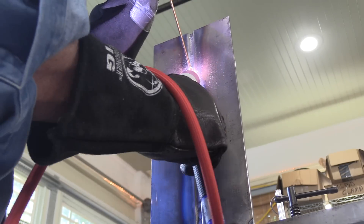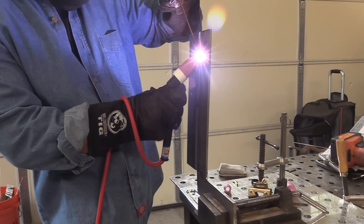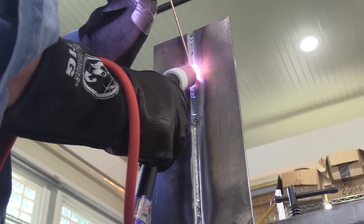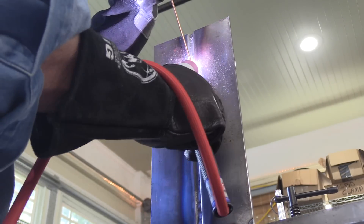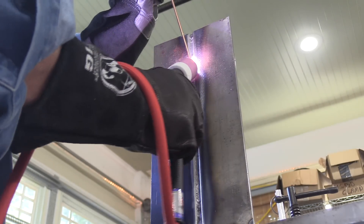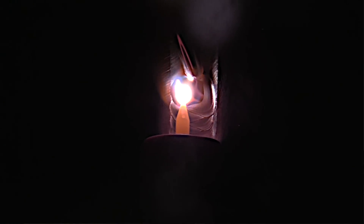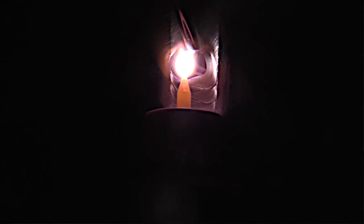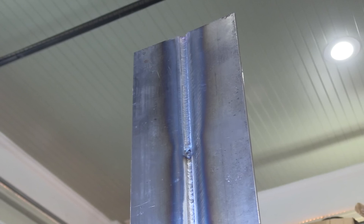Walking the cup is one of those things I used to do all the time as a pipe welder, but then I transitioned into a different industry where it really wasn't done at all — but I can feel it coming back. I'm using a flex lock 360 torch from CK, and you can see I've got the torch head kicked back quite a bit. You could also do this with a flex head torch but you wouldn't want to do it very many times. I'm trying to hold the torch rather loosely — not a gorilla grip — so I can be relaxed, and I'm putting just a little bit of pressure on the filler rod so it's there if it wants to take a little filler. Pretty much I'm just walking over the filler.